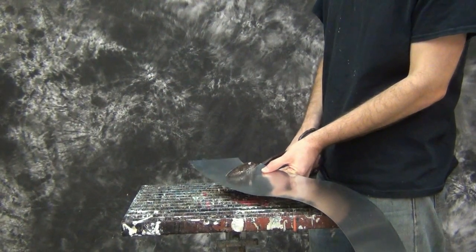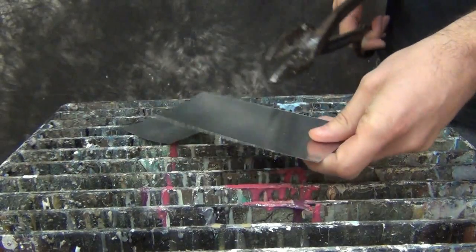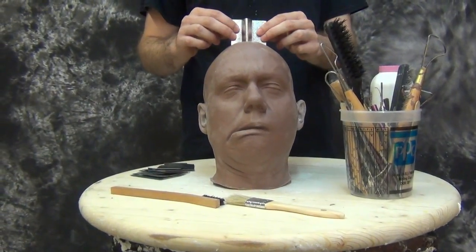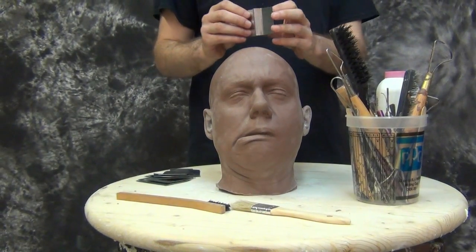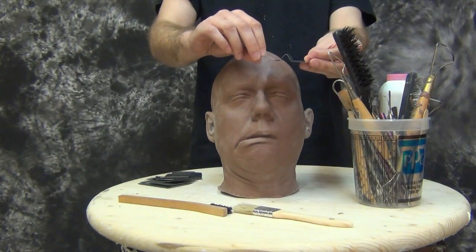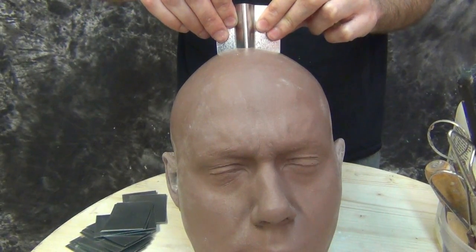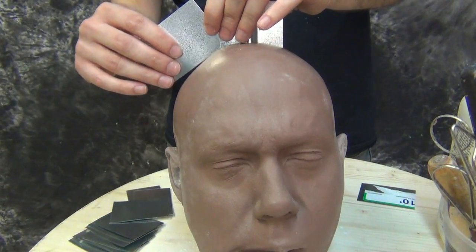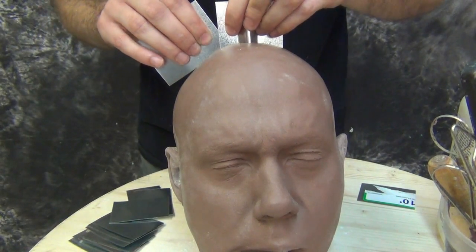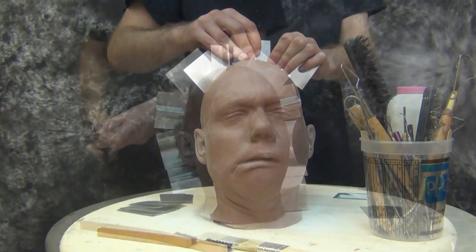For the shim method, the way we establish a parting line is by cutting up thin pieces of sheet metal — some flashing that you can pick up at any hardware store — into little rectangle pieces. To make your parting line as clean as possible, you want to choose a material that's thin and strong. To create keys, we crimp our flashing into little triangular shaped keys and press them into the clay. You want to be as precise as possible; press those straight into the clay and leave as little deformation on the surface as possible.